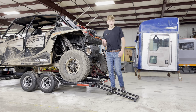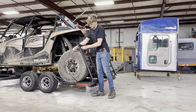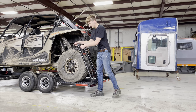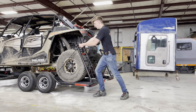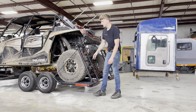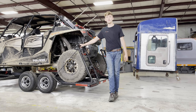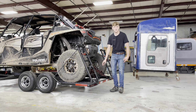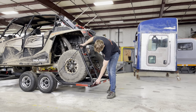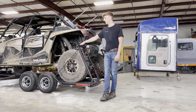When you've got your machine loaded and you're trying to get the ramp up — real simple. You pull the ramp all the way against your tire, put the chain through the little slot in the ramp, pull it all the way through, give it a little pressure, and then lock the chain in. This keeps the ramp secured so it won't fall off or fly off. The ramp is welded on, so you don't have to worry about removing it like some other trailers. It stays on, though you can take it off if needed by grinding the tack on the hinge.